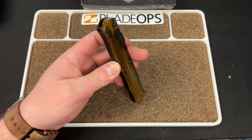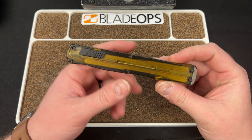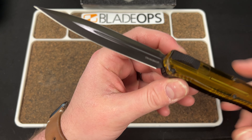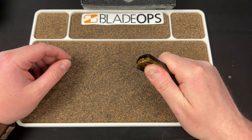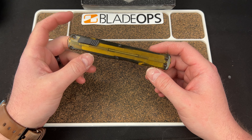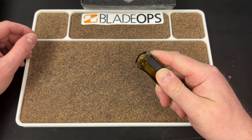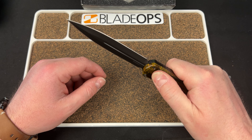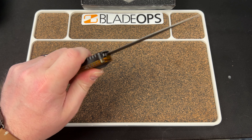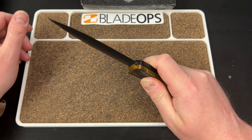I'll be honest, right off the bat, I think it looks cooler in pictures. Can't reverse the clip. It's got like a four-inch blade and this is MagnaCut. I did ask Heretic what they heat treat their MagnaCut to when I had the Colossus, and they said 60 to 61 — that's pretty poor for MagnaCut. You'd definitely want to see that above 62. But this thing has a really good action — it really fires and feels super solid.